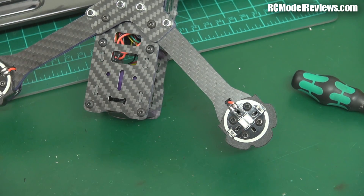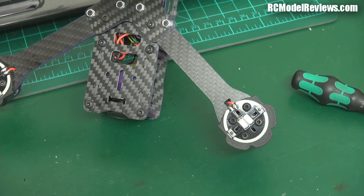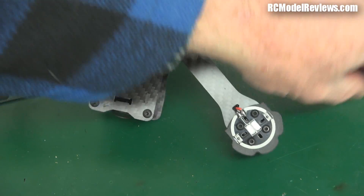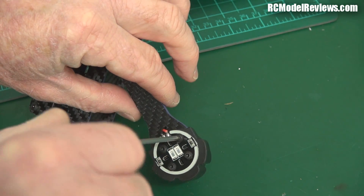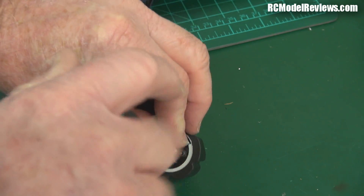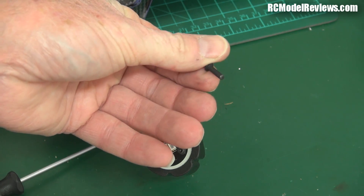This is worse than I thought. Some of the bolts were actually a full turn out — they weren't even seated home. You don't do these up tight because it's a soft mount, but they were actually poking out. The heads were proud of the LED strip, so they had actually backed off a turn just in transit. And there's no Loctite whatsoever on these bolts. Look — there's a whole half a turn before it even starts encountering resistance. So these bolts aren't even nearly tight enough, and not a drop of Loctite on there.